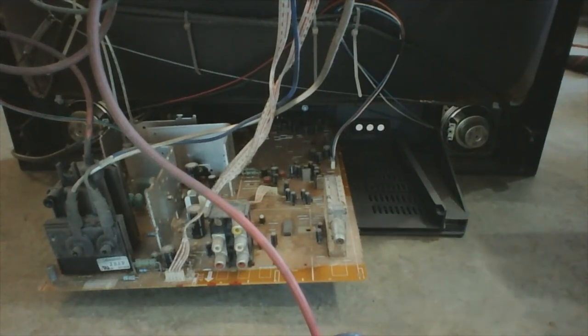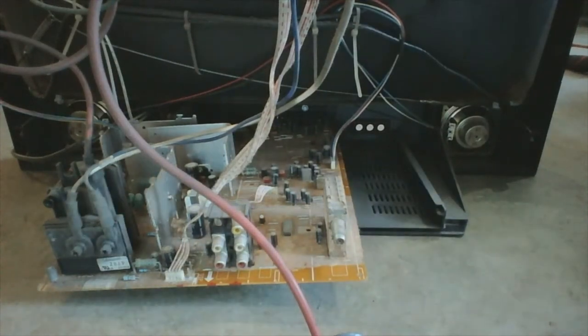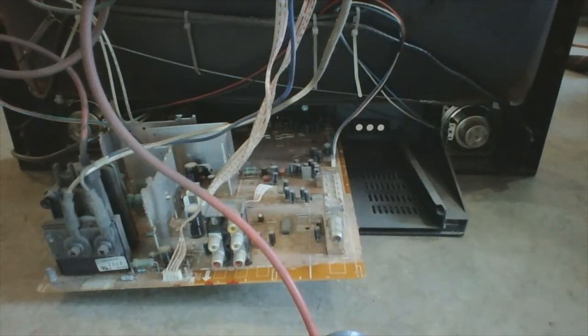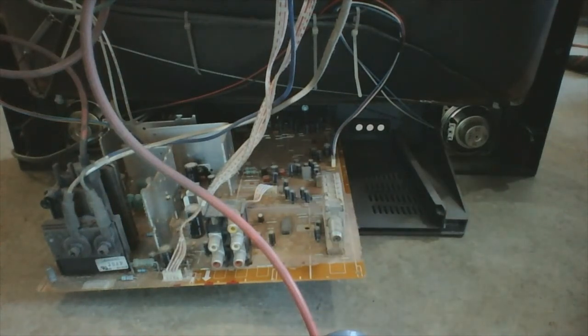Anyway, next I'll take out the circuit board which contains the flyback transformer, as well as some capacitors, voltage regulators, transistors, including this giant metal oxide semiconductor field effect transistor, resistors, the microcontroller and small signal processor, and finally a ton of diodes, some zeners but mainly ultrafast recovery rectifiers. I'll try to avoid cutting wires because, well, that's a bad practice.